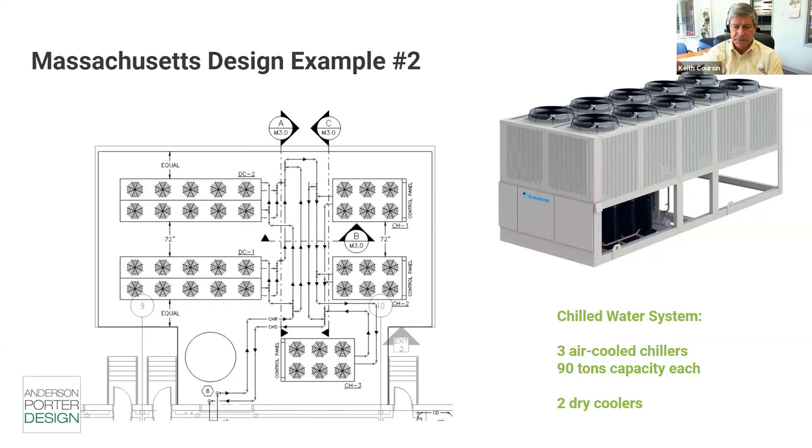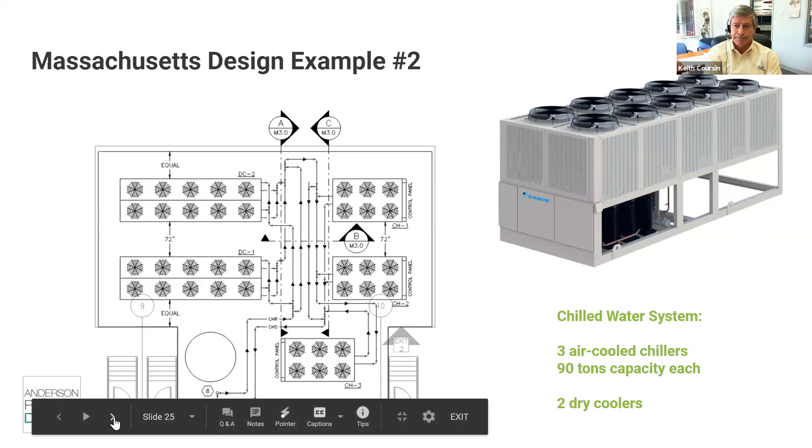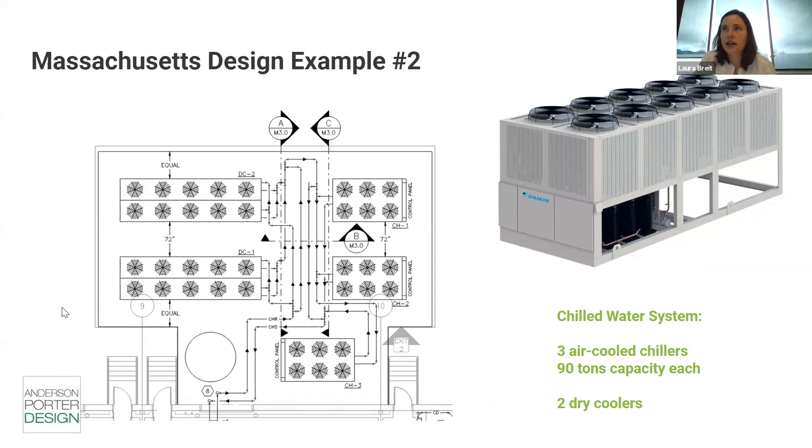One other option available in the marketplace for these particular air-cooled chillers is they have some heat recovery options, cleverly named a heat recovery chiller. You can use that as a methodology for shifting some of the heating demand from the cultivation rooms to other portions, including the dehumidification side. That's a really good point — oftentimes something like that wouldn't have a huge upcharge, so by the time you're into a hydronic system, you might as well spend the extra money on a better chiller option to get some of that heat recovery.